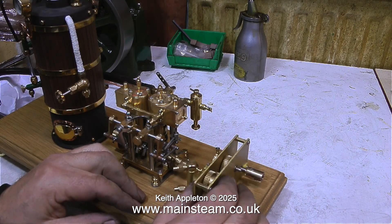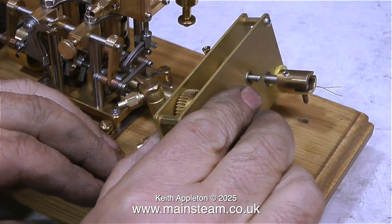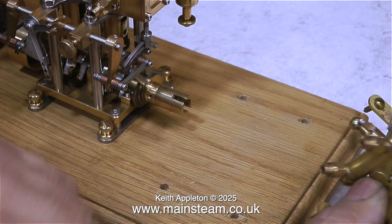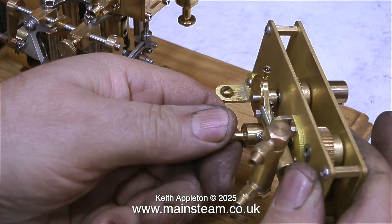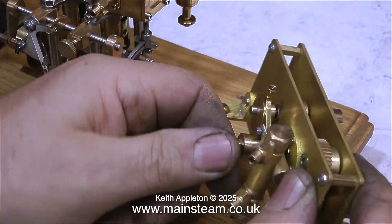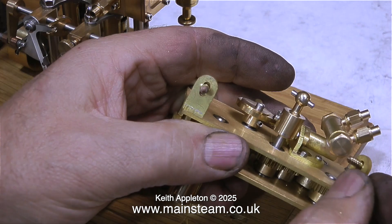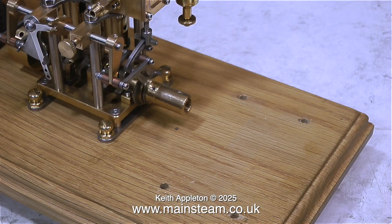As you can see, it is a twin cylinder engine fitted with Stevenson's link reversing gear, and it works okay. The gearbox, on the other hand, with an integral water pump, is really not a good idea. The wooden base must be quite soft because the four screw threads are a rattle fit in the holes. Looking at this gearbox in detail, it really is very well made — ball racers fitted where they need to be, and an integral water pump make it a really useful device for driving twin propellers from a single engine.